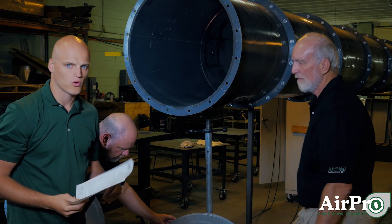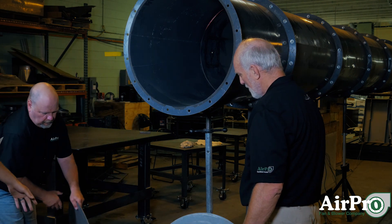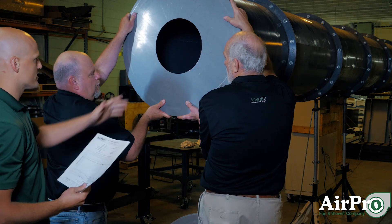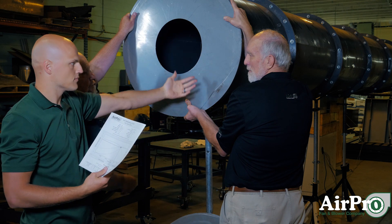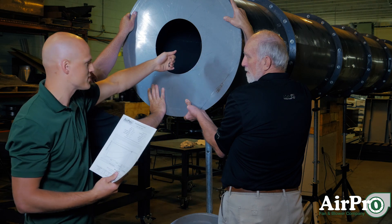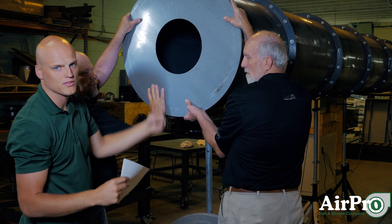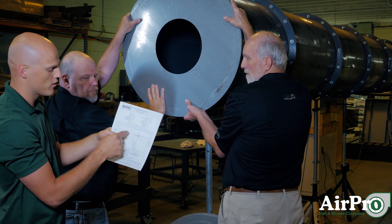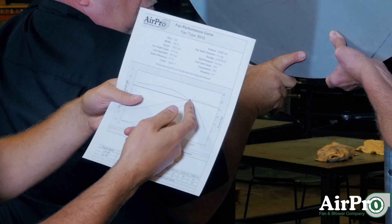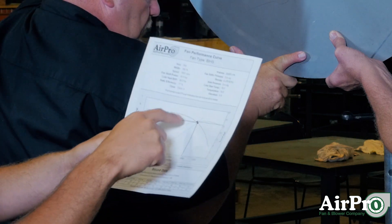Along the way we're going to put various different plate sizes on this outlet opening. We're going to demonstrate a plate with a moderate orifice size in the middle. This orifice is nowhere near as large as our previous opening was, so this has built some static pressure into our system. We're somewhere around the middle of the curve — we've built some pressure into it, but we're not all the way up at the highest static pressure point yet because we haven't closed the orifice plate down further.